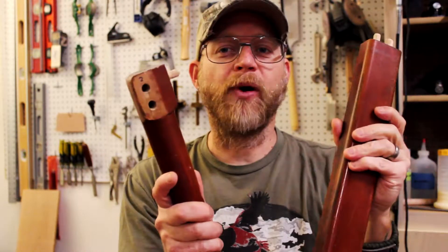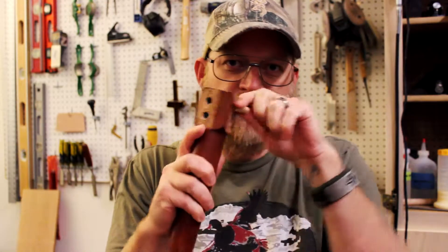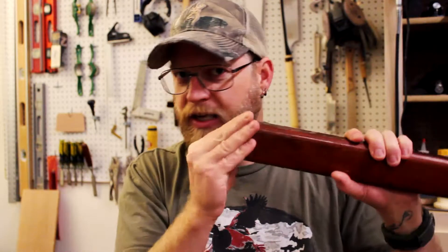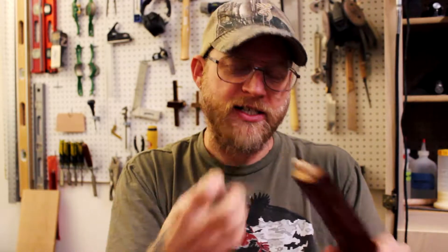The proper way to fix your chair is going to require a little bit of work, but it'll be well worth it. These pieces of furniture without metal parts are actually going to become valuable and will last a really long time — your lifetime. Here's the deal: take it apart, remove the extra glue that was already on there, give it a little bit of sanding. Not too much — you don't want to remove a bunch of material and make it loose. You want it to be as tight as possible. Rough up that surface so the glue has something to bond to.